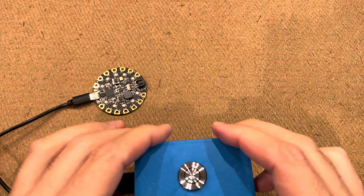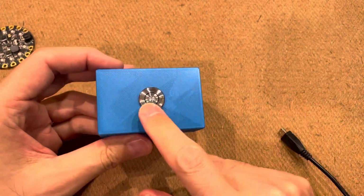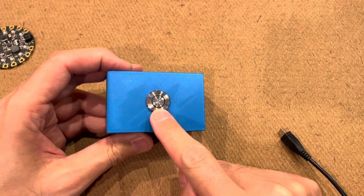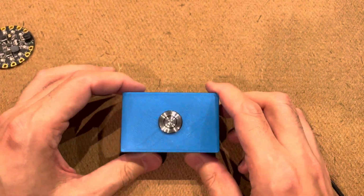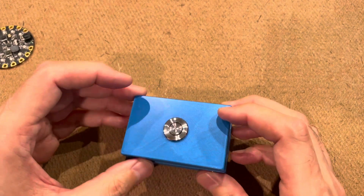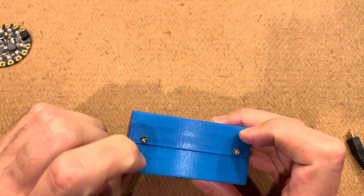The point is, the primary problem here, the primary piece of bad news, is that there is a problem with my design. The clever thing that I thought I did to make this light come on red and then switch to green is not correct at all. There's no path for the red light to get to ground, and I'll talk about that in a future video, but as a result, I have to do a redesign on this board and figure out how to solve that problem properly.